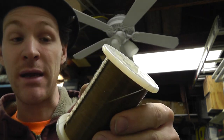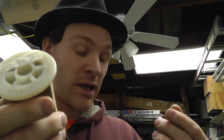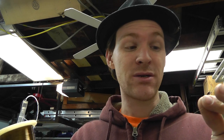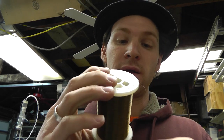The other thing Don sent me is this right here — this is the stainless steel wire that was at Stan's estate. I've calipered it, measured it, done some interesting tests, played with it, cut off a little piece. Don doesn't know if there's enough here to do the whole VIC, but I think there's quite a bit. I measured it to be around 16.5 ohms per foot; another guy said about 15 ohms per foot. This is 430 stainless steel enamel wire — tiny stuff.